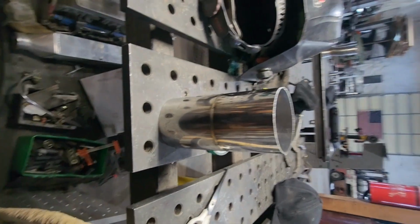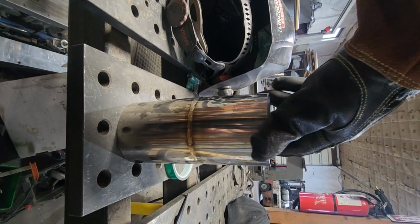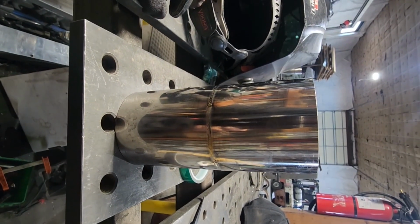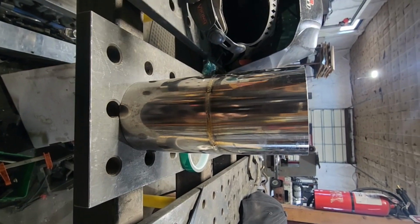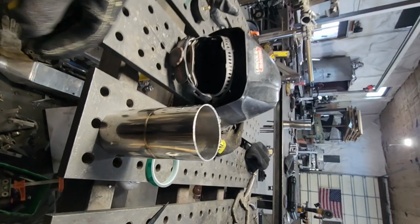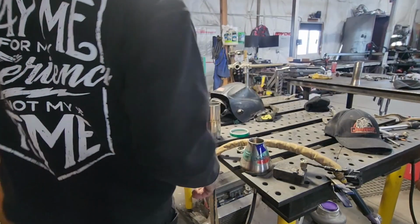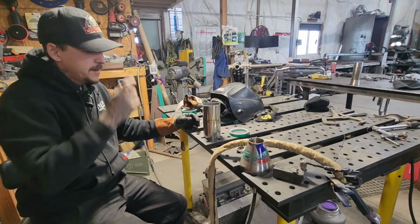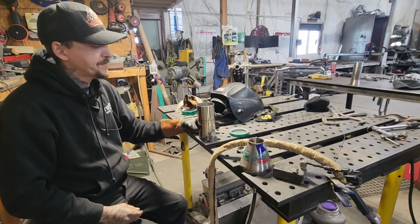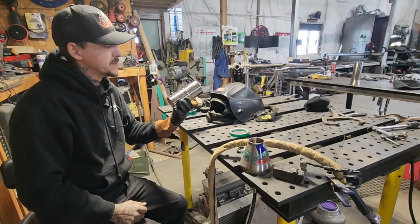And that is going to be, not only does it allow a place for the material to oxidize and possibly grow bacteria. Like I said, the outside of the weld looked fine because we had the coverage, but on the inside of the tubing, say it's at the dairy and you are too lazy to back purge. Sorry, hang on a sec. Say you're at the dairy, you're doing a job for the dairy and you're too lazy to back purge it. You're like, oh, screw it, it won't make any difference anyway. Well, that is the perfect breeding ground for bacteria. And that is the importance of back purging.